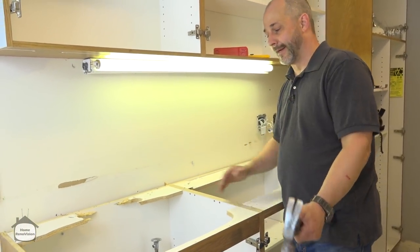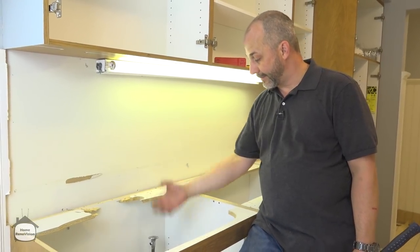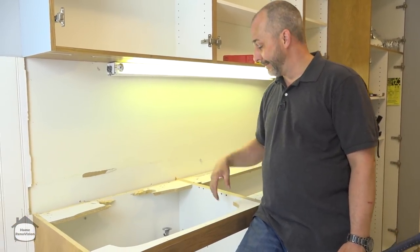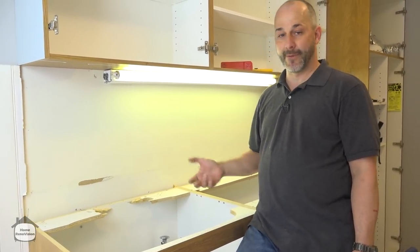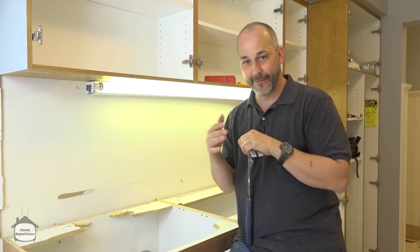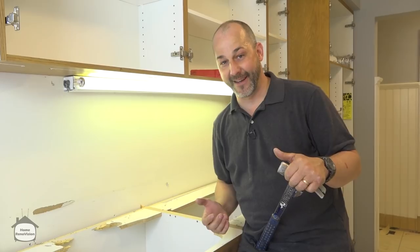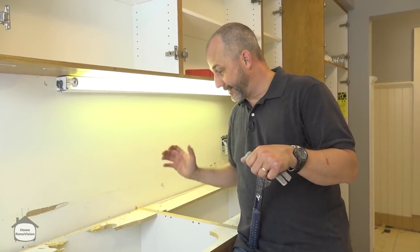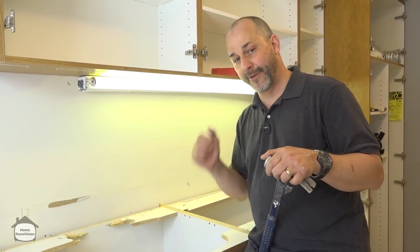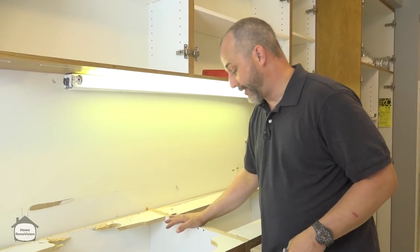One of the ways you can save a lot of money is to take care of removing the old sink and counters and reattaching the plumbing yourself — watch a couple of our videos to get a handle on it. Countertop companies will have all kinds of up-charges above the contract price. I've seen it before: clients expecting new sinks installed today, and the installers walk in and say you have to disengage all your plumbing — it's in the fine print but no one told them. If you know what's coming and you're prepared, they drop it in nice and easy. If you're not prepared, you could almost double the cost of your installation.